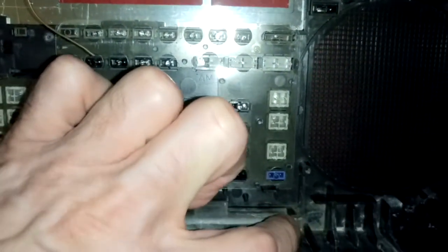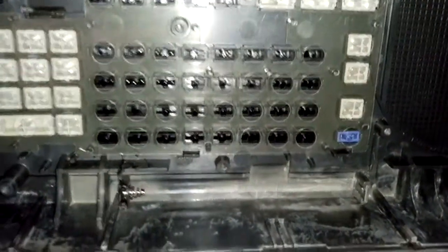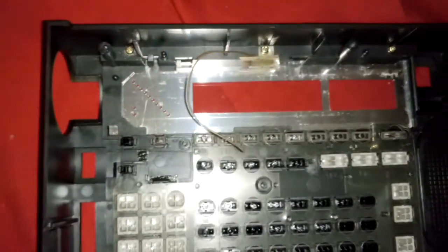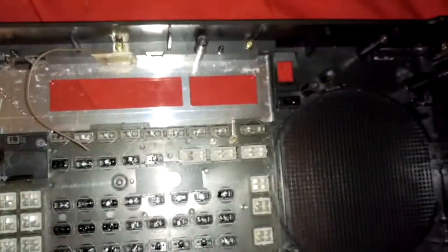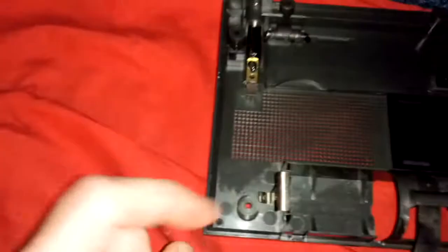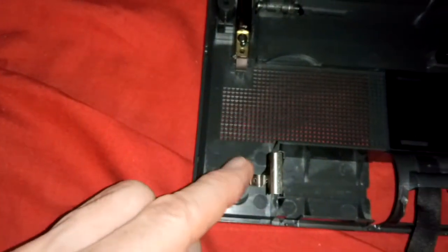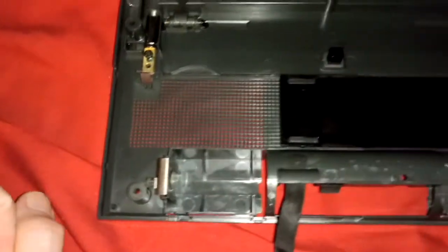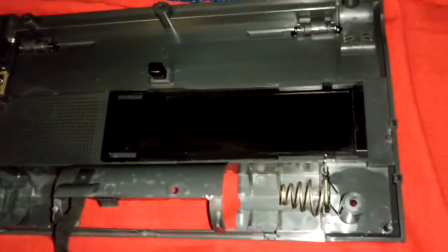This is your memory battery — there was some corrosion in it, it's clean now. Just a plastic piece and there's your ground wire. Overall the case of the radio is pretty good. This makes contact with the circuit board — that's why you could get dropouts sometimes.